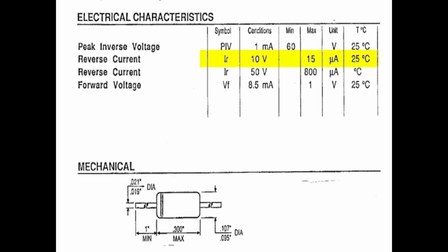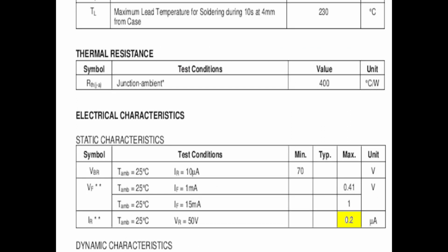The 1N34 has many times more leakage current than a 1N5711. This actually normally would make the 1N5711 be called a better diode. Making a crystal radio with a real 1N34 diode and then substituting the 1N5711, I discovered that indeed, where a 1N34 works fine, the 1N5711 would not work. And this led me to try to figure out why.